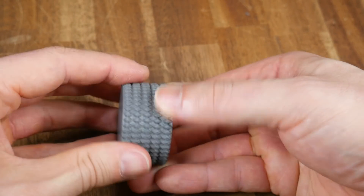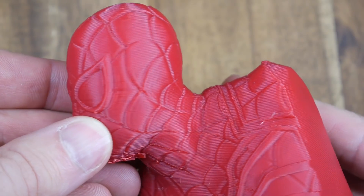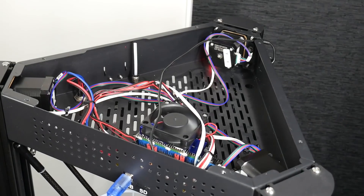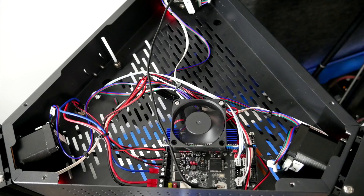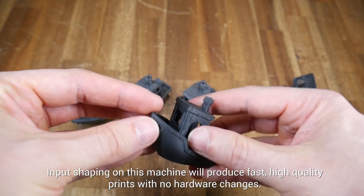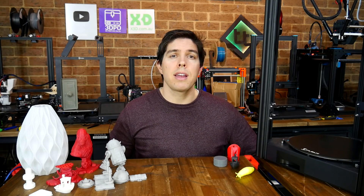It's not perfect, but it's fundamentally a sound machine. I feel you can get pretty good results out of the box by using the quality preset, and still acceptable results in much less time using the fast preset, provided you can live with a little ringing. Another reason I quite like it is its potential for upgrades. There's only six bolts holding on the top panel, and underneath is the electronics. The main board is an SKR version 1.3, so there are leftover ports to add additional features, and we have the firmware source to make that easier. There's plenty of room up the top for a neat install of a Raspberry Pi, ideal for Octoprint or in my case Klipper, as I feel this printer can be beastly with Klipper's input shaping to cancel out the ringing present in high-speed printing. Overall it's a tick from me, which is why you'll be seeing this machine in the future as I perform some upgrades.